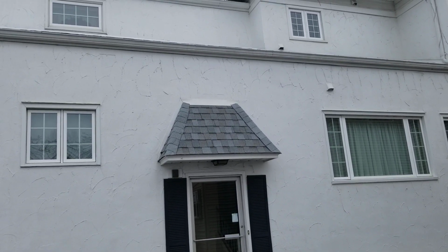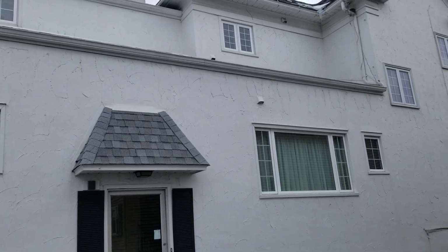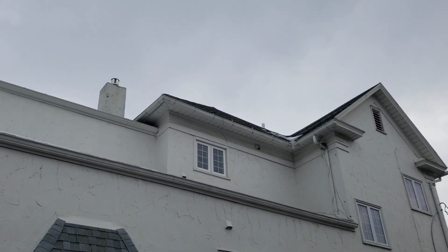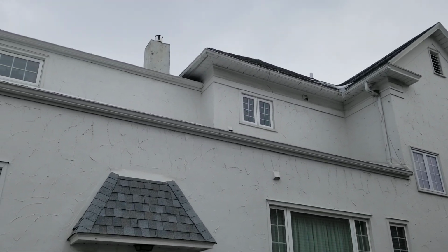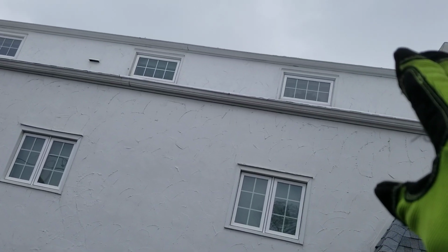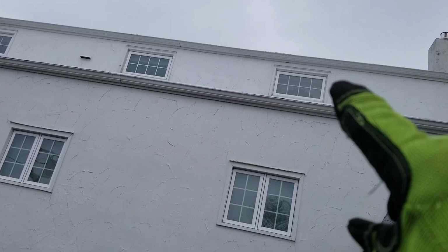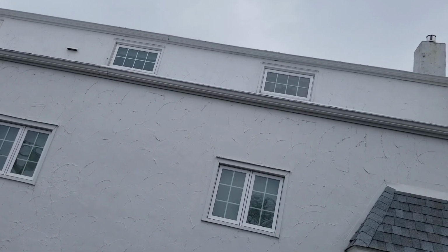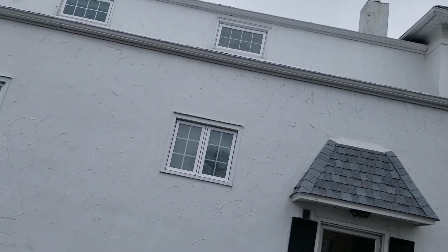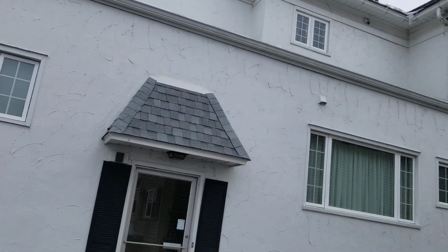What am I trying to say? The underlayment. Okay, we'll go through and get the spaghetti of wires out of there, and it looks like the building's had ice problems for a while. The way I understand it, we're going to replace this gutter on the upper too, but we're not doing anything with the heat cable. Look at the possibility of sealing that off to the roof edge when we get that off, and then definitely redoing this roof and apron flashing on these 2 lower wings.